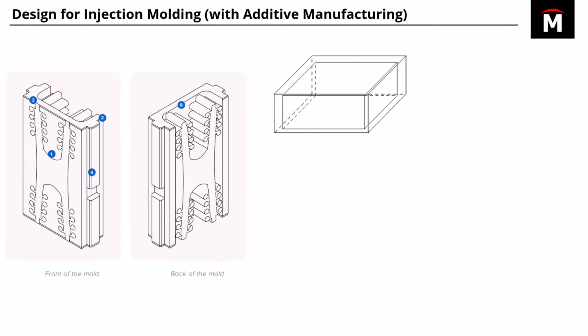Another thing to consider is scaling the physical part itself. So in CAD, and obviously it heavily depends on the shop material, but say for that high flow, high temp flow, low viscosity polypropylene, you'd want to scale that by like 2%. So you have your mass strap in CAD, scale it up by 2%, and then do your Boolean cut operation to build the mold itself. And that's just to counteract any shrinkage of the material post mold.